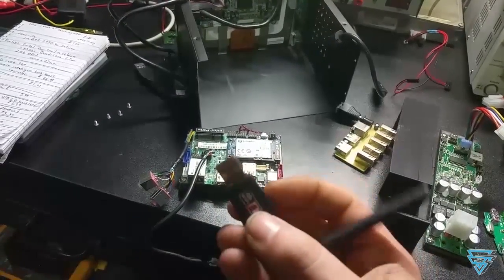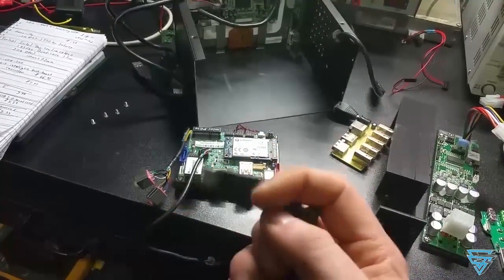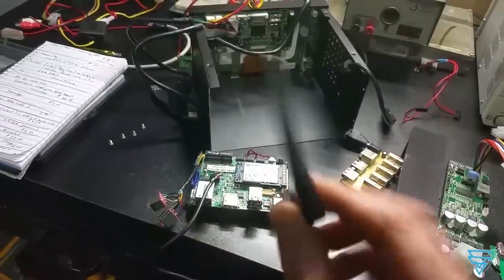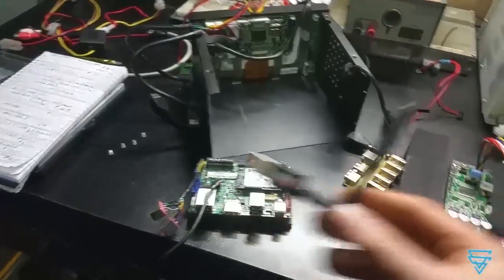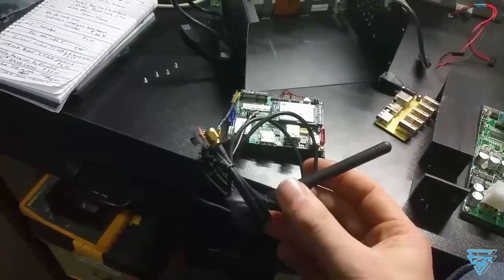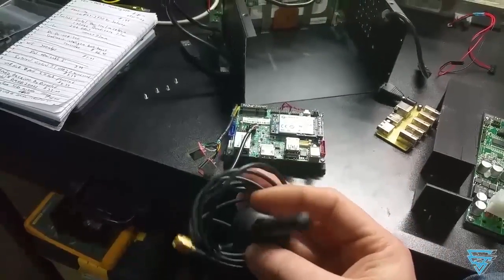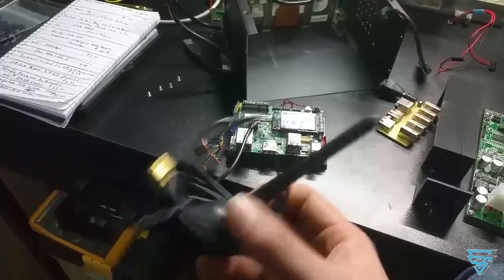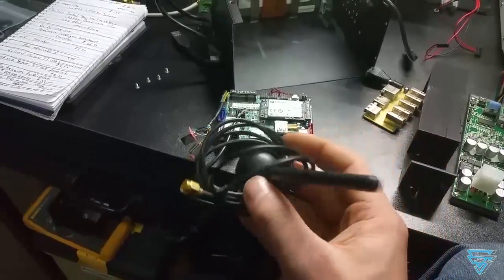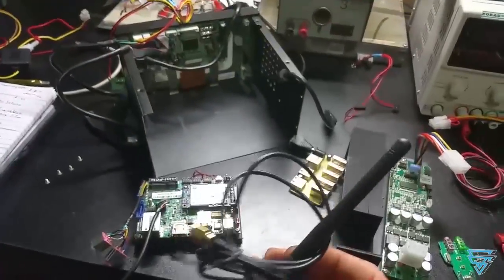You can go for the small dongles that don't have the external antenna, but this is going to be in a big metal dash, and I have been getting good results with the antenna kind of wedged inside, and it's been working okay. But I wanted the option to grab something like this and hide it up in the dash closer to the plastic, so I had a good signal, because I really want to be able to cycle my car via remote wake up and be able to send music and movies to it from inside on my network without having to go out to the car. That way when I go for a ride, I already have the music I want to listen to, and other various reasons as well. So that's the reason why I went with an external antenna instead of the internal antenna. The reception seems to be much better.